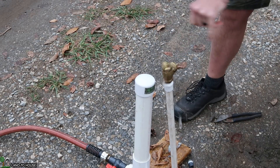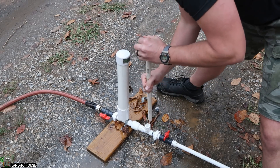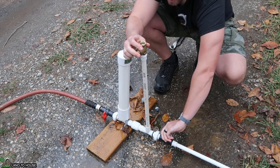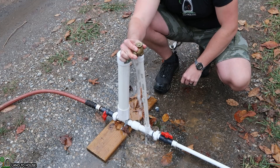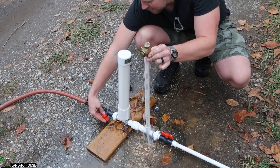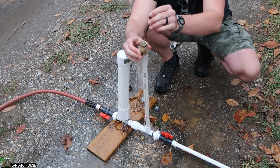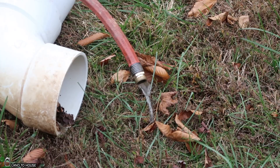Water shot up — that's going to be an issue. I did not glue this new standpipe and it just popped right off. Due to limited time I may just hold it down while we cycle. The pump is cycling with the delivery closed. Opening it — water is definitely coming out the top. As I push the waste valve down, water comes out the delivery pipe, but the pump will not cycle on its own, which means we need to go higher on that waste valve standpipe.